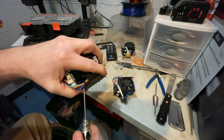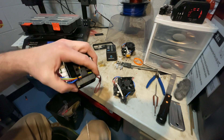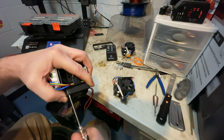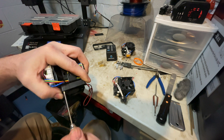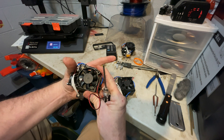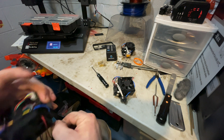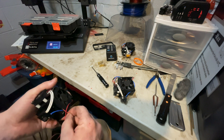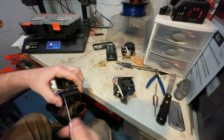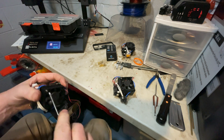Once you get it in, there's room on the other side, so if you have a bolt that's too long there's clearance for it. You just need at least 12 millimeters to get through the fan. Square it up a little bit — it's not going to go anywhere. Make sure that your plug is not underneath the fan, then tighten it back down.